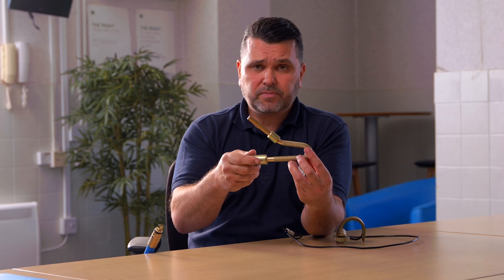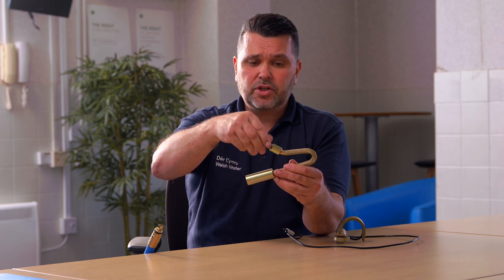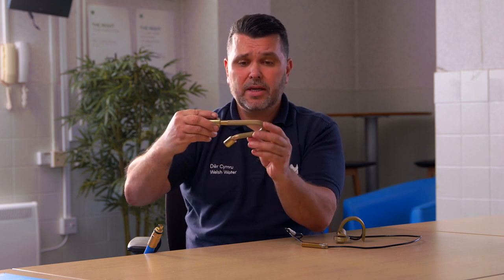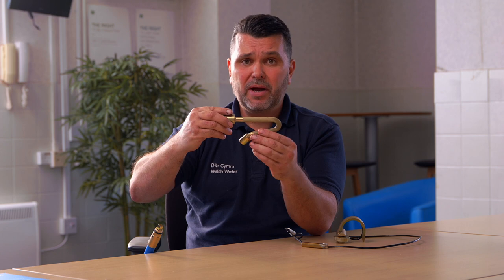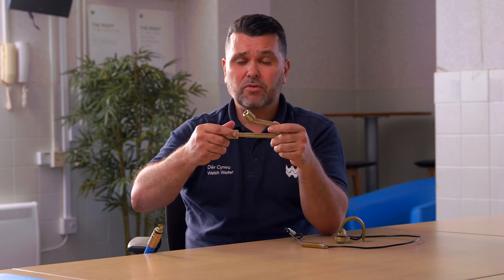It can be used for other things too. If you've got a band seal which is hanging out of a UPVC joint — we've all seen them flapping in the bottom which debris is catching on — go down to the band seal, hook it on. Don't pull it to snap it, because you will literally snap it. What you need to do is hook the band seal — if you can imagine my hand is the joint — hook it and wind it, and you will peel that band seal from around that joint until it pops out, removing the obstruction, and then it can be fully removed.